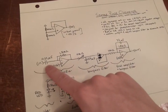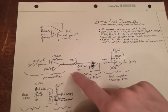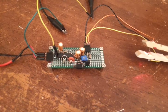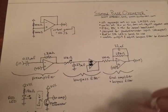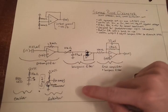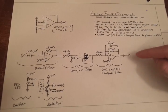The signal comes in, and the first thing that happens is it gets decoupled — that removes the DC component through a 0.22 microfarad capacitor. Then there's a high-gain filter stage, followed by a rudimentary low-pass filter: just a variable resistor and a capacitor. I can turn the resistor while looking at the oscilloscope and adjust it until my heartbeat is still visible but the 60 Hz AC noise is gone, or at least dramatically reduced. Then we have a unity gain current source, followed by a 10x voltage amplifier with a little low-pass filtering, and then the output. Everything here, start to finish, is extremely inexpensive.